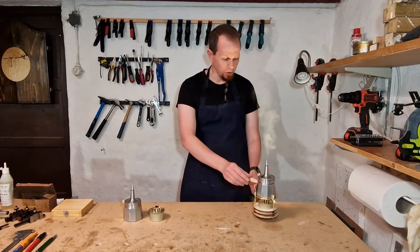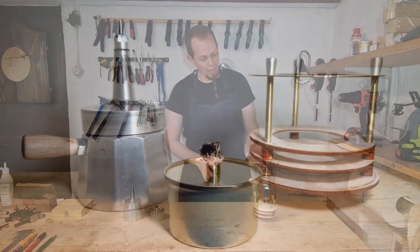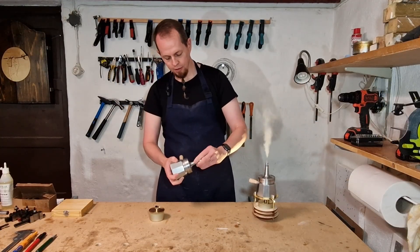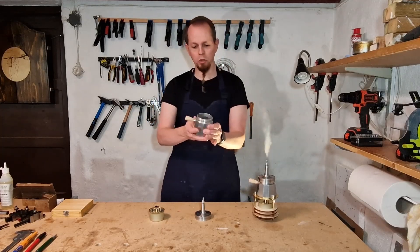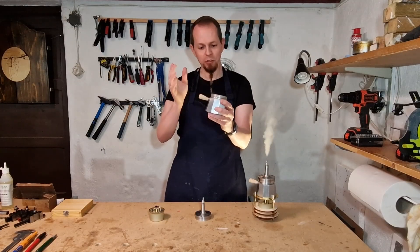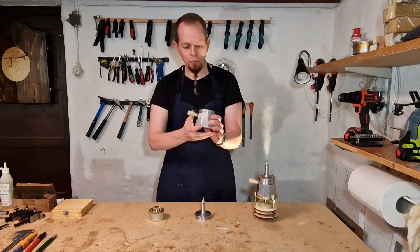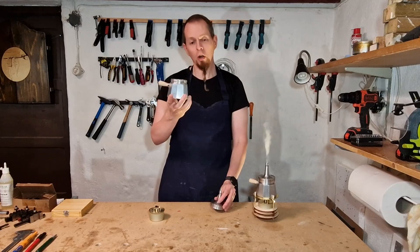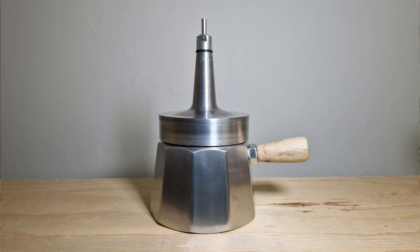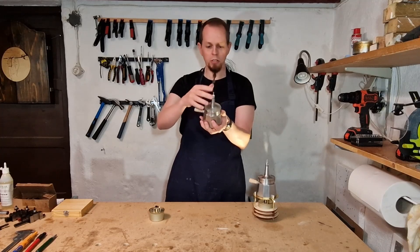The boiler is complete and it's working really well. I'm happy with how much steam it generates and the power that it generates for the steam engine itself. It was basically just three parts. The first part is of course the pot, and the pot has a few small bits. The best part of this project so far is this handle - it's so cute and I like it a lot, it's probably my favorite part. The pot is converted from a mocha pot, the top part I changed to be a spout, I removed the pot section and added a small adapter from aluminium. Since everything sealed already I didn't need to do much to get this working.